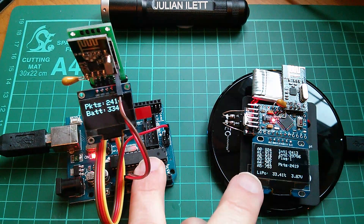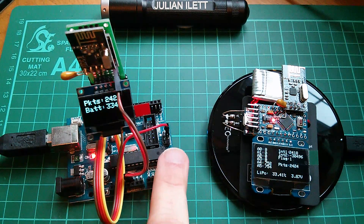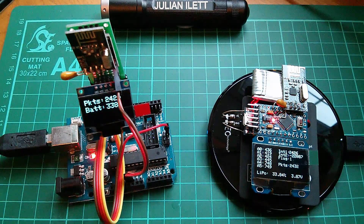It's difficult because it's running very slow at the moment. Several went up to 1,023 and then to 0, because it's probably picking up mains hum, so it's swinging wildly between the two extremes.